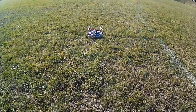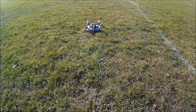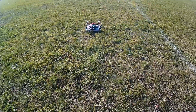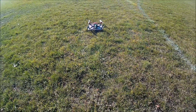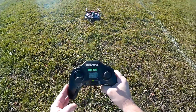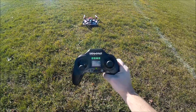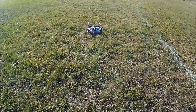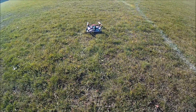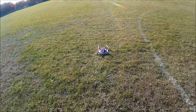We'll have four green lights. The furthest one to the right is just an indication for LVC. If that blinks, that means your battery is low. But it's solid green, so we have a fully charged battery. Telemetry on my transmitter is fully charged too. And we'll just wait. There she is — four green boxes. Let's give this a go.